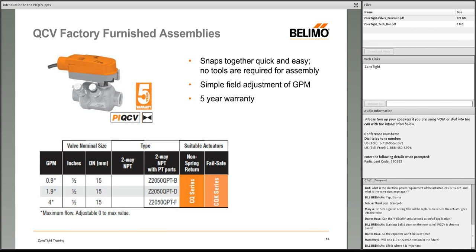Question: Will the supercapacitor fail over time? The capacitor is designed to outlive the lifespan of the actuator. Supercapacitors in actuators had a poor reputation 15–20 years ago, but the technology has changed enormously. Belimo spent about five years of R&D ensuring the supercap would not be a failure point in the actuator.